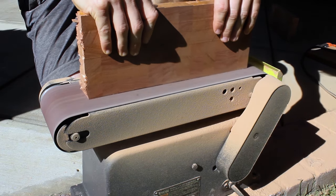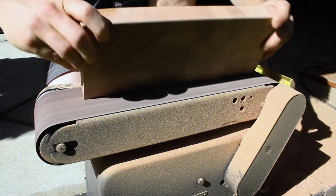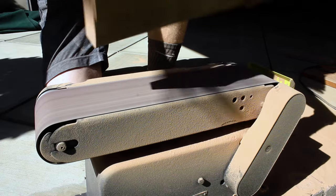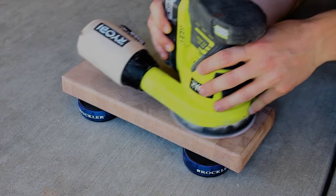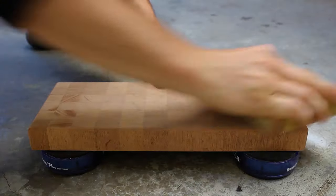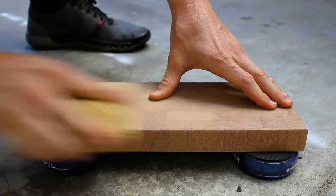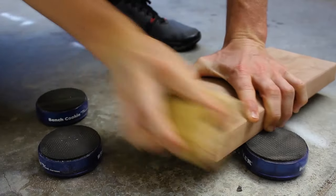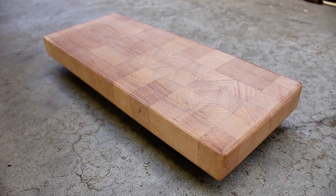I could clean up all of my sides as well as round over the edges lightly. A router works really well for this if you want a specific edge type like a chamfered edge, but since I wanted just a rounded edge, doing this on the sander worked fine. I then finished the board with my orbital sander at 120 grit, followed by hand sanding at 220, 320, and 400 grit, including a wet sanding at 220 to raise the grain so it wouldn't raise and become rough again when the board got wet later. Then it was time for mineral oil — food safe, of course — and this is clearly the best part about making a cutting board.